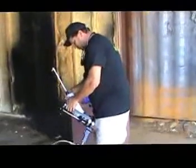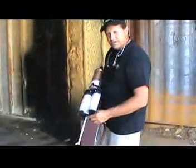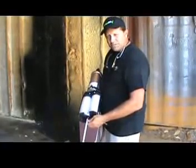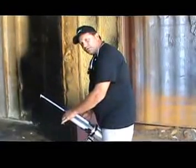Very important: when you load the cartridge, do not tilt it down. If you start tilting it down once the cartridge has got material in it, this is going to start mixing, and then it's going to actually go ahead and clog up your static mixing tube. So make sure you keep it upright until you get ready to spray.